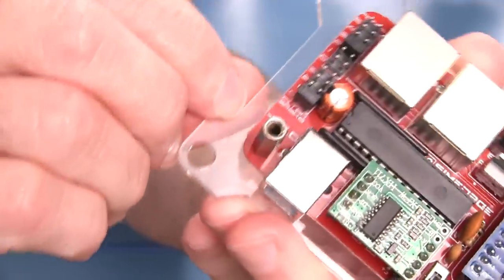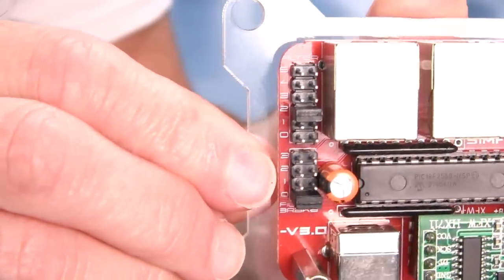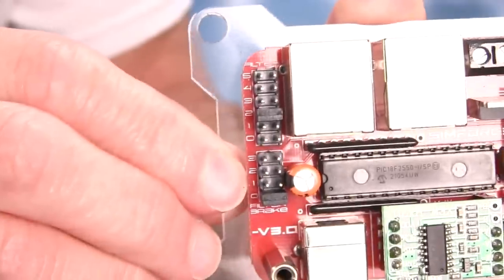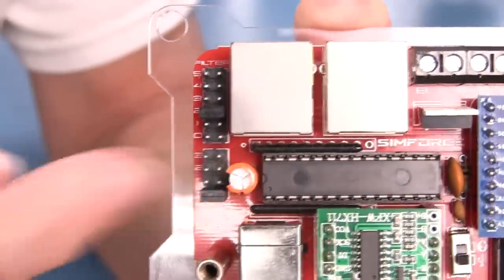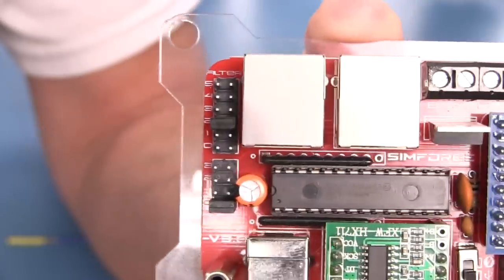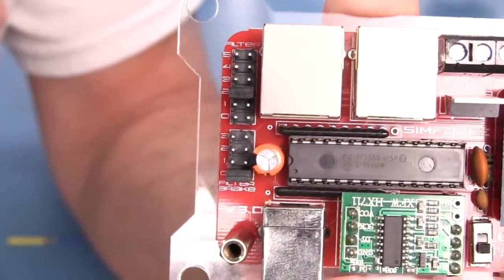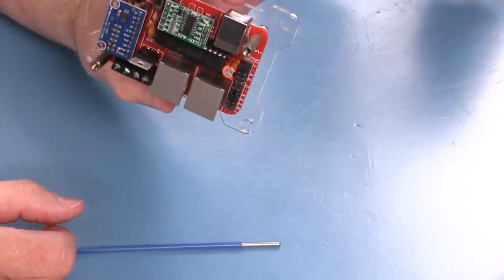So now I'm in number two. Or is that number one? 1-0, that's two, I think. All right, so there is two. That would change the amount of filtering that I'm getting through the chip in here, and that would alleviate any shaking or jerkiness you get in the signal when you're viewing the raw data in an application like DI View. So, I think that's it for showing you what's going on with this circuit board.